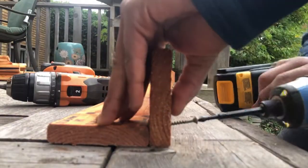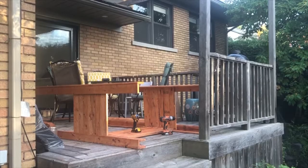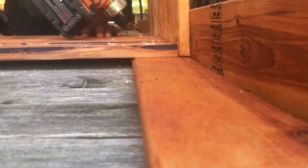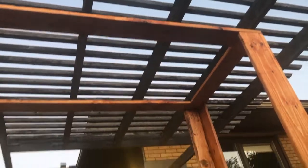Once the stain had dried, I moved all my materials to the location the planter box would stay and started assembling. The first step was to assemble the posts, which consist of two 1x4s fastened together with screws. I pre-drilled all holes with an 1/8-inch bit to avoid splitting the wood. Following the posts, I installed the side pieces of the planter box. I marked the top and bottom of the box directly onto the posts, laid the slats in place, and fastened them. My screws were an inch and a quarter and the lumber is only a half inch thick, so I angled all my screws so they did not come through the other side. I repeated this process for all four sides, and added a batten diagonally across the long side of the box to add strength. Then I fastened the top pieces onto the posts and stood the entire assembly on four feet.